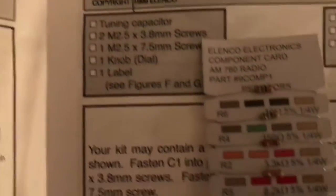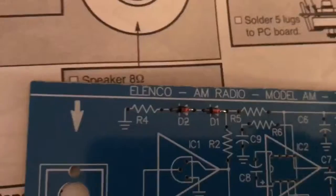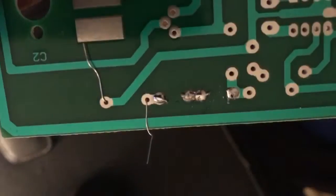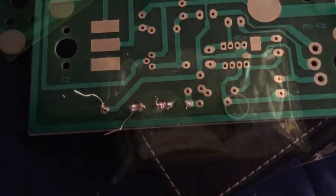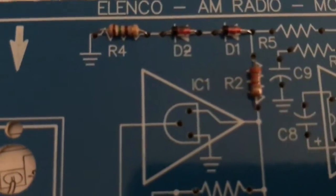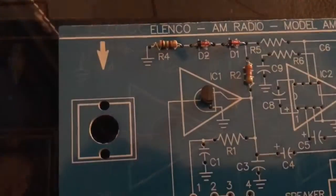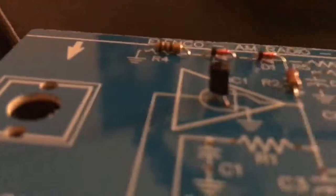You'll find the next thing on your side, which will be R4. Then you'll find your PC board — look, they all go right there, all four on your PC board. Bend the leads back; be careful with the side arrangement because you don't want any bridging. Then go ahead and follow the instructions, find the next piece, and just keep going through every piece exactly the way it says in the instruction booklet.